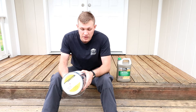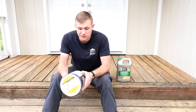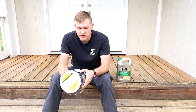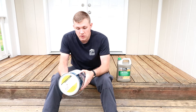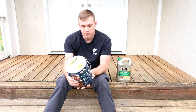Allow the area to dry 24 hours under normal dry weather conditions — additional dry time may be needed. If needed, lightly sand to remove any wood fibers or fuzz. Test for loose fibers by applying and removing duct tape on wood surfaces; if fibers are present, sanding is required. For concrete surfaces, avoid areas that are structurally weak or subject to hydrostatic pressure above 8 PSI. Allow new surfaces to cure for 30 days. Clean and etch surfaces using a product such as a muriatic acid etcher to achieve a textured profile similar to 150-grit sandpaper. If the previous coating is failing or peeling, use a paint stripper to remove it.